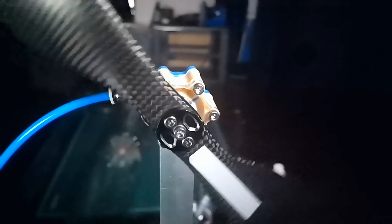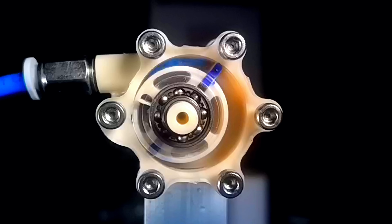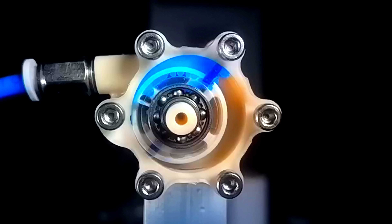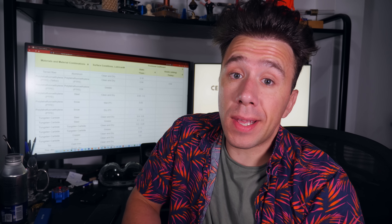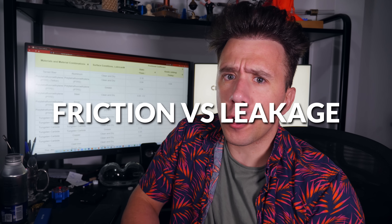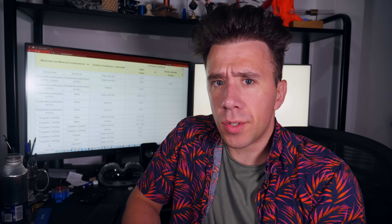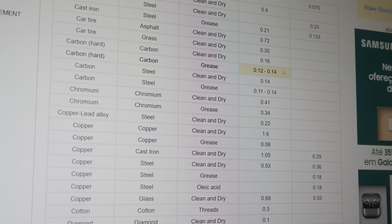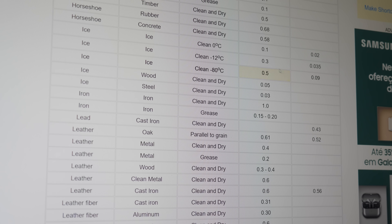To see where the leaks were, I injected the engine with blue water paint — because if the paint leaks, you can bet the air leaks as well. As you can see, there are leaks everywhere. It is becoming clear to me that this is going to be a battle of friction versus leakage: if I tighten the dimensions I get friction and the engine slows down, but if I loosen the dimensions I get leakage and the engine slows down as well.